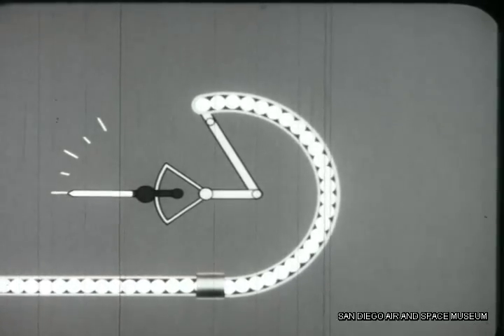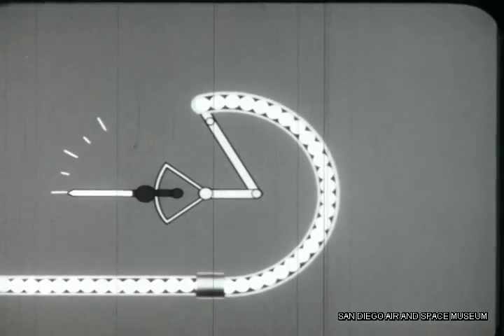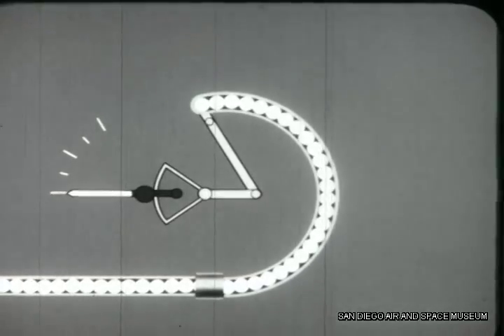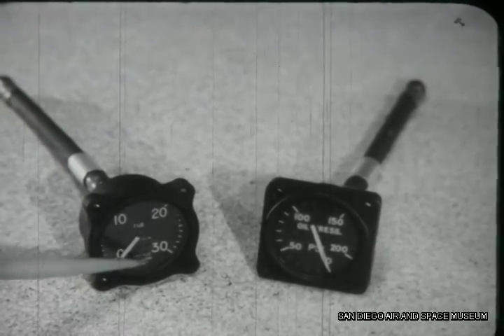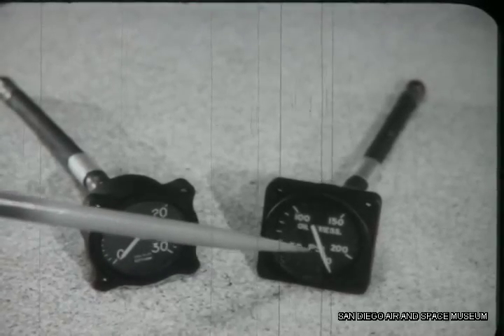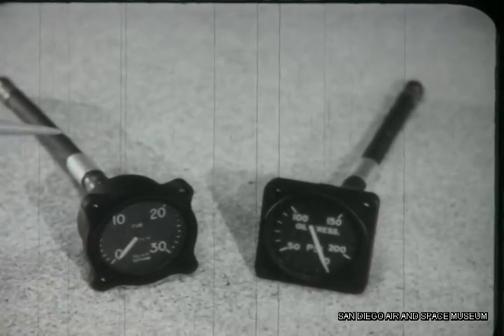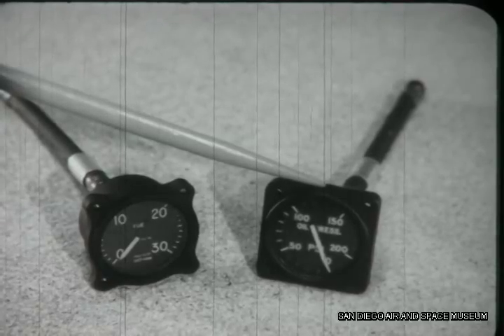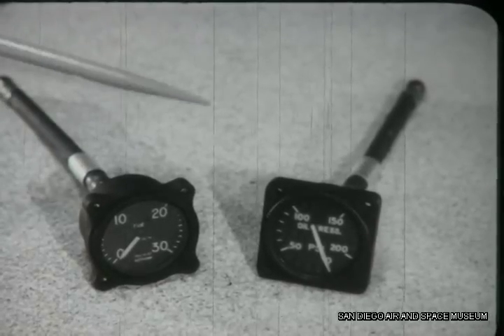This of course is a simplified drawing — actually the scale is not on the bourdon tube. As pressure increases, the movement of the tube causes the indicator to tell us the degree of pressure in the system. As pressure decreases, the indicator returns towards zero. In the instruments, a mechanical linkage attached to the bourdon tube operates a rotating pointer on a scale. Fuel and oil pressure gauges of this type have one poor feature: since the bourdon tube is inside the case, it is called a direct indicating gauge, and it is necessary to have tubing carrying fuel and oil under pressure into the cockpit. If either line should leak, the cockpit might be sprayed with fuel or oil, causing a fire hazard.